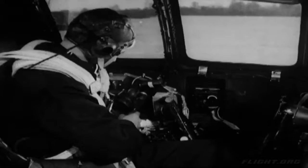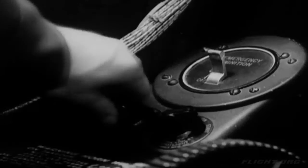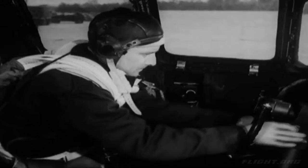Look over your oxygen mask and make sure your portable oxygen bottle is fully charged. Then try out the cockpit lights. To test the ultraviolet lamps, turn on the switches and twist the shutter. You should then be able to see the light. By turning the shutter back, you can control the amount of ultraviolet light emitted.